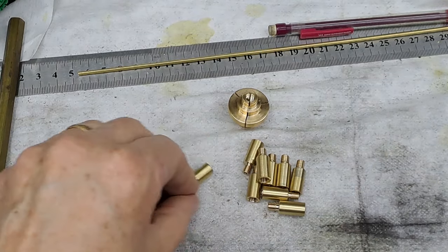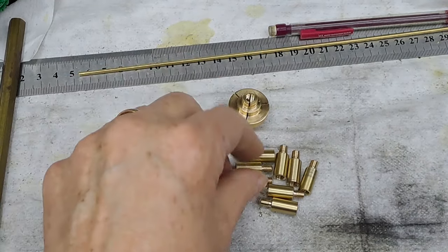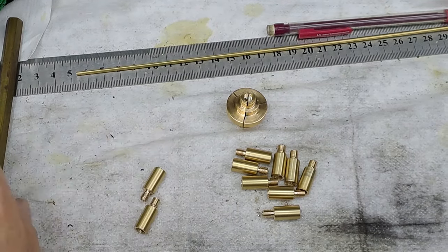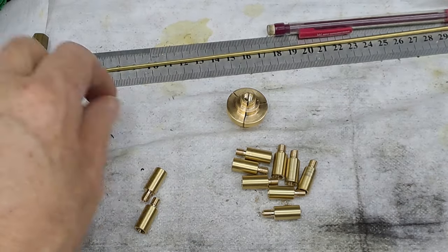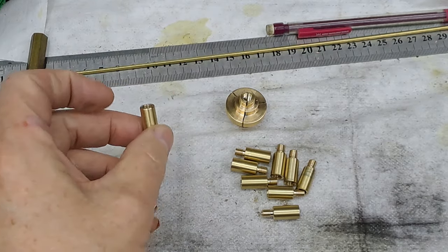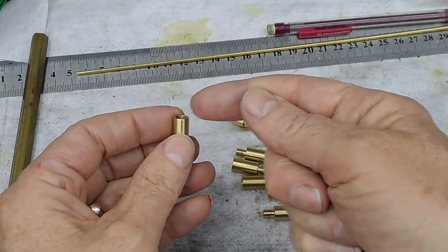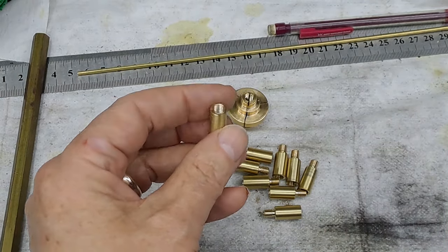So I've got to make 8 now little caps, little kind of thumb knurled caps that go into the top of these 8. These 2 get a different kind of cap because these then have the bit of hexagon, which is here. Turn down a thread, of course, which goes onto there, put the recess in and make sure it's the right length. Gets a hole going into it, but not all the way through, because then when that's screwed into here, it then has a pipe that goes in for a silicon pipe to connect to a little oil pot on the side of the frames.